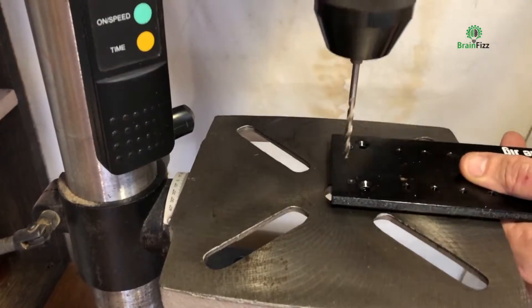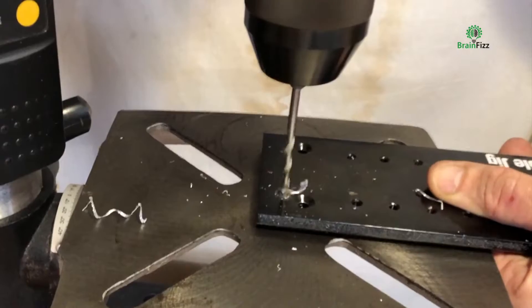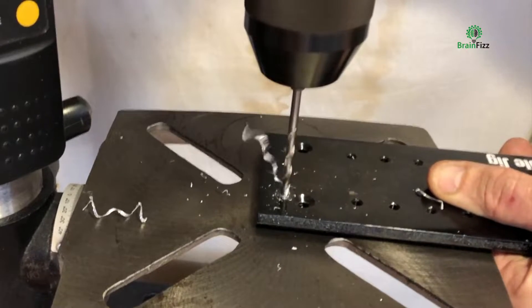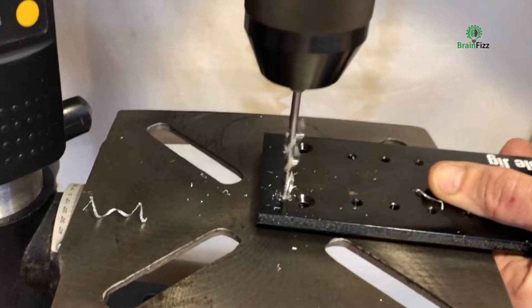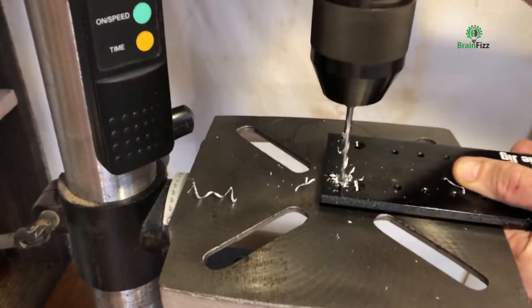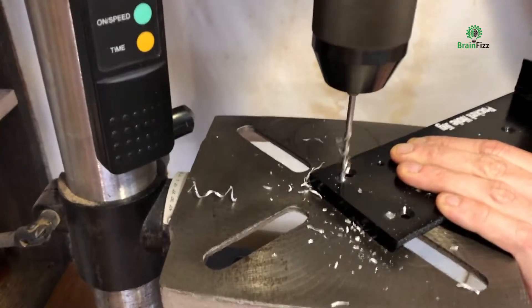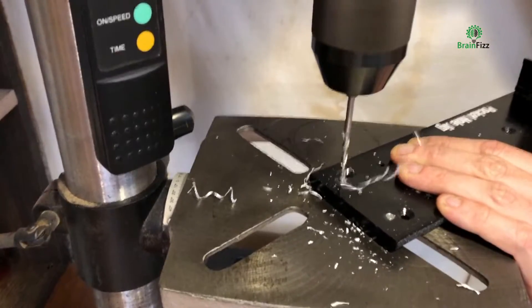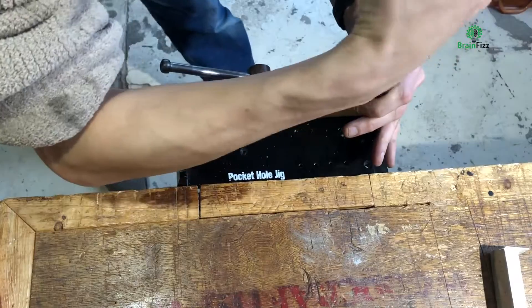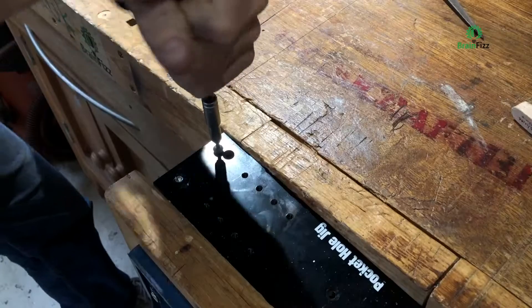I took it apart and re-drilled the mounting brackets before the actual toggle clamp part of it. That would allow me to get longer and a better array of different sized pens into the jig. I set the punch the way I want the holes to be and drill them out to about 5.5mm for a pilot hole, which can then be threaded for the M6 threads on the little bolts.